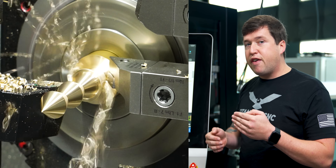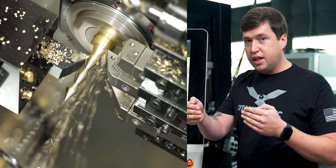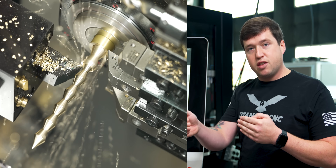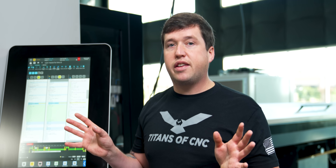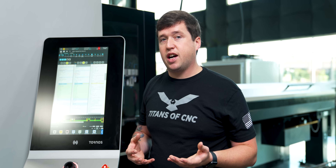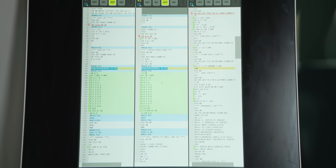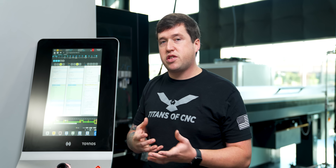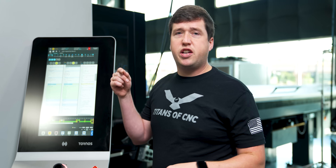I fed the gang tool a little bit faster than the turret tool, which is why when you watch that cut you'll slowly notice the turret getting further and further behind — and when they're done it has a little bit of catching up to do. I can program whatever I want that turret to do while head one is doing its own thing. You'll also notice with superimposed cutting there will actually be code on both channels — if this were just synchronized, the second channel wouldn't have anything in it.